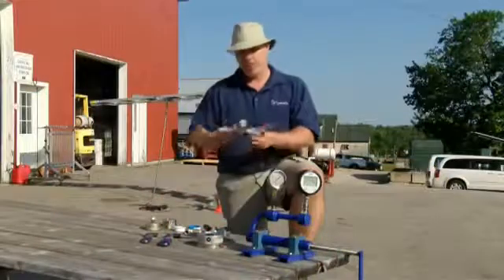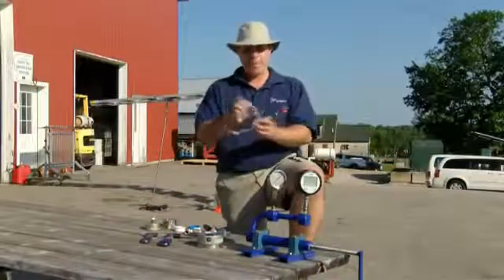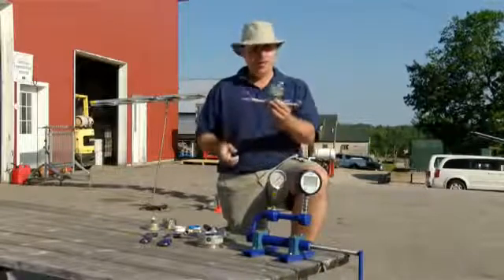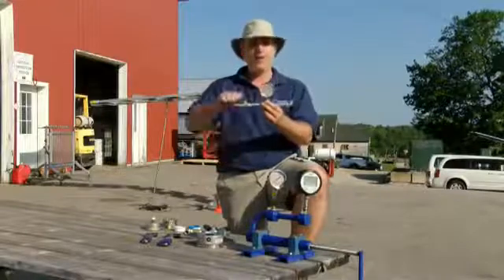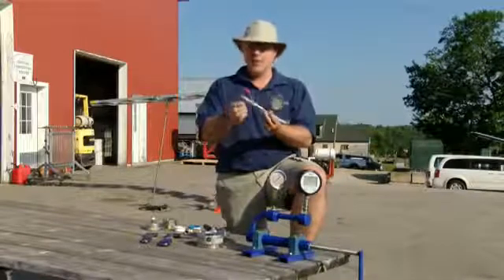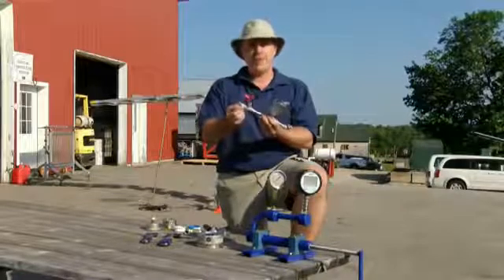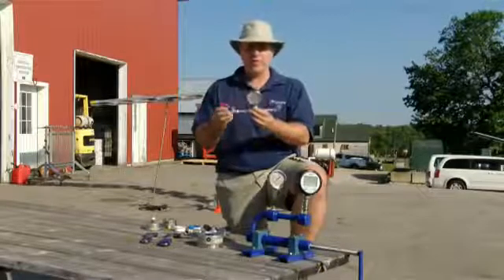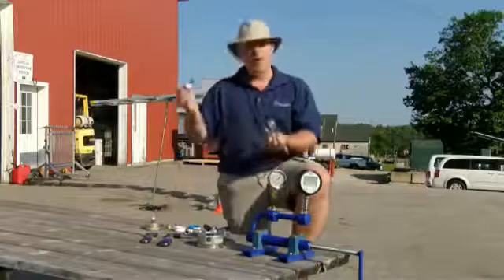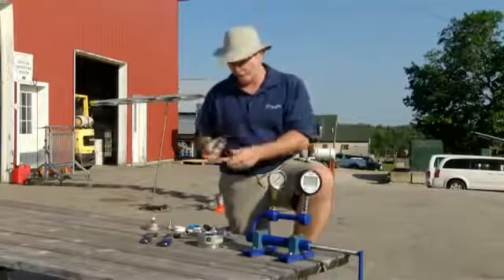But a grower in southern Ontario — a former vineyard guy — at a workshop said any grower can build one of these for $40. He just used threaded pipe, and even the valve is optional. Every operation has an air compressor, so as long as you get the right fitting for the air compressor, this is within your reach. It's the same idea: you have a gauge you know to be accurate, and then the gauge that needs to be tested.